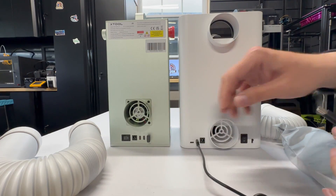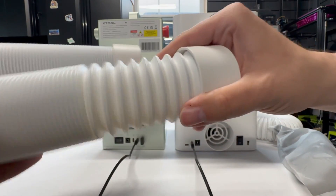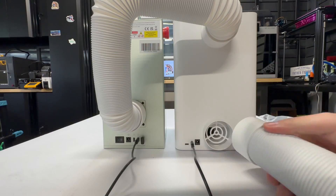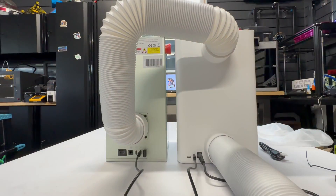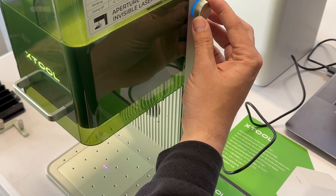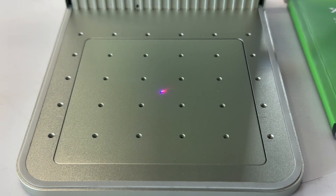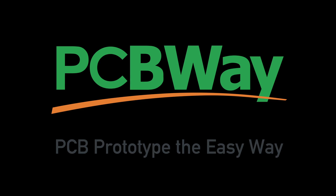It's pretty simple to attach. Let's hook up the USB — oh, this is satisfying. Attach your hoses, then go ahead and plug in your power. I would suggest labeling those power bricks. Let's remove the lens cap. And to focus, move this jog knob and combine the blue and the red dots. Plug the USB into your computer and launch Xtool Creative Suite.